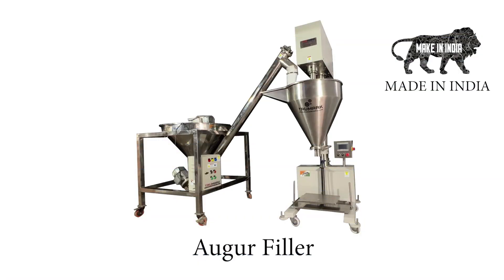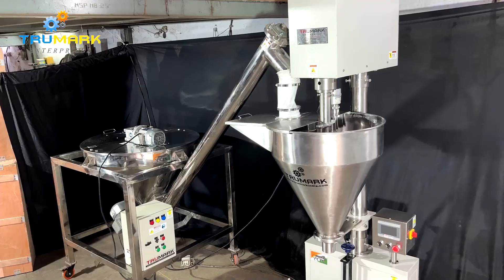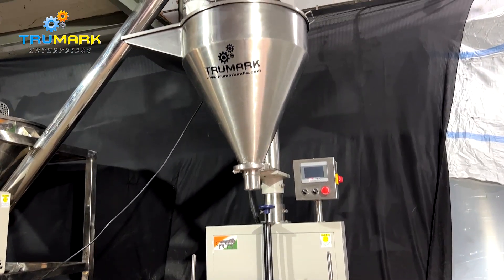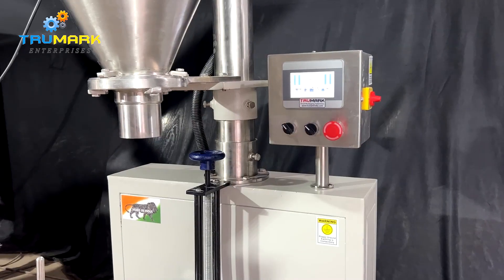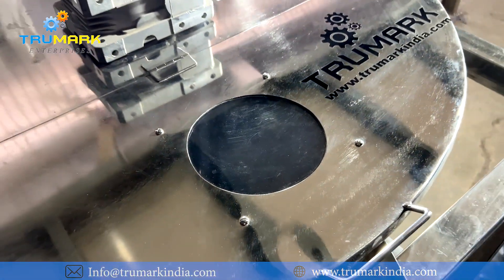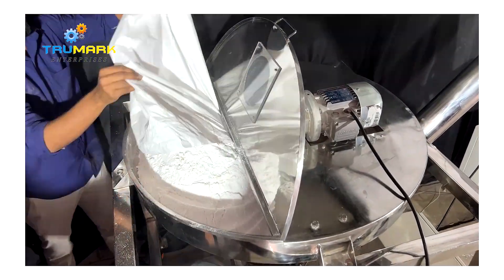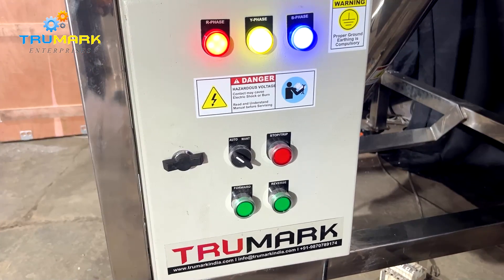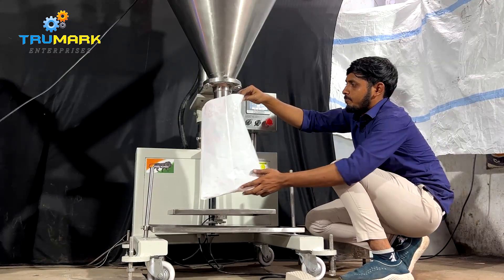This is a Mark Present auger-type powder filling machine with screw conveyor elevator. The auger filler is a screw-operated powder dispensing machine controlled by time flow or load cell weighing type controller. A screw conveyor elevator is used to feed and maintain the product level in the filling machine hopper. Both machines are fully customizable as per customer application — the screw conveyor is optional when opting for a weight-controlled auger filler, which gives very good accuracy regardless of product level in the hopper.